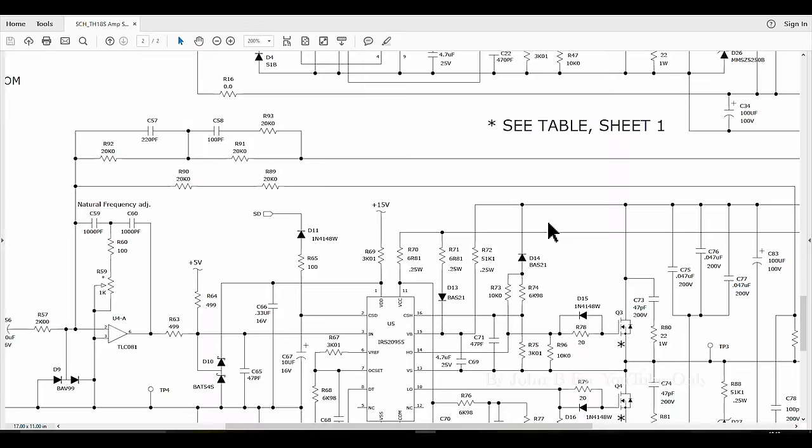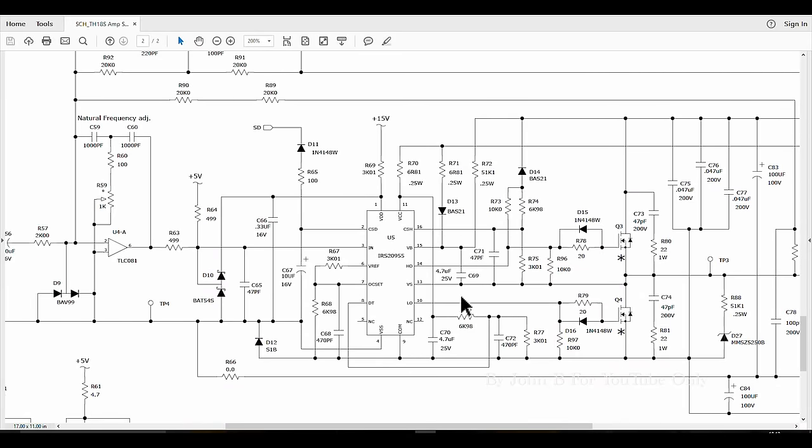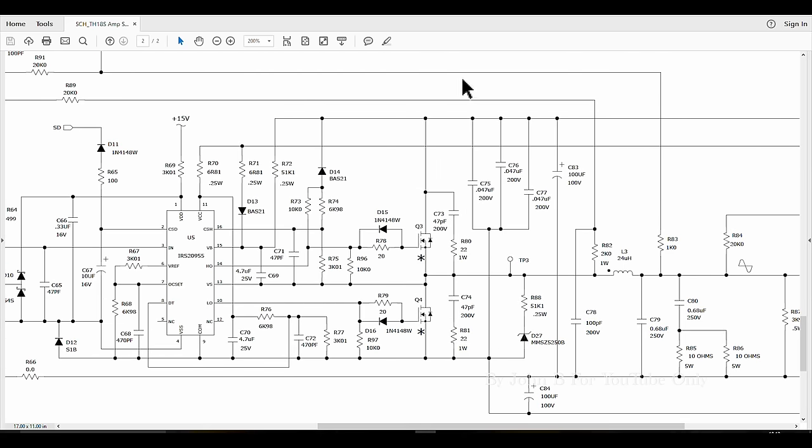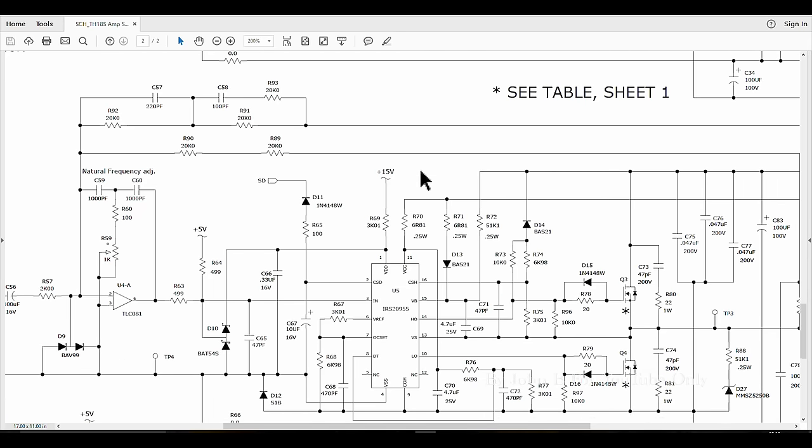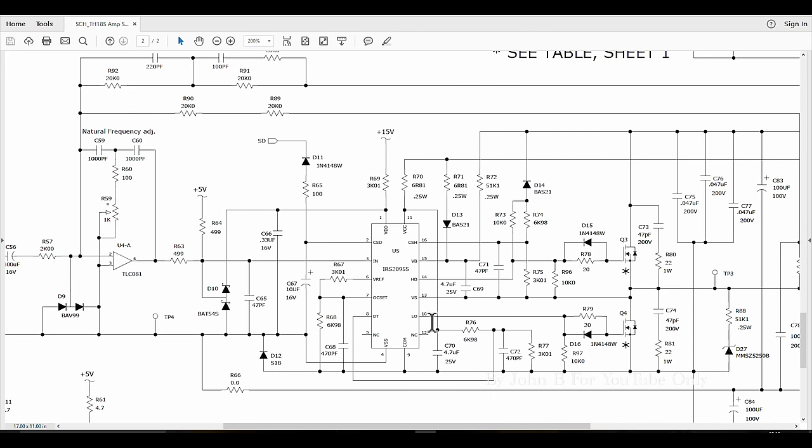But then the one I put in over here was giving me a 2 or 3 hertz kick on these FETs every few seconds, or a few kicks a few times a second. And then with the feedback from here, that would come back to this op amp, which is known as an integrator, and you'd see that kick back here, which would then drive this again. So it just keeps on repeating, kick, kick, kick. And I thought, is that trying to start because of this? No, it was doing its own thing because it's a fake chip.